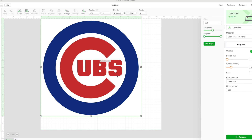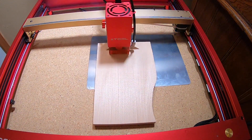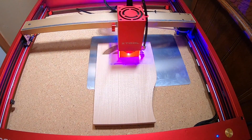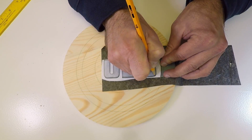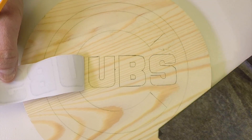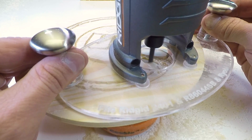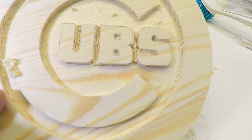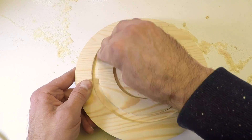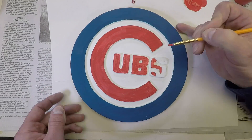I'm going to try making a Chicago Cubs painted logo on a three-quarter inch thick piece of basswood, but before I do it on the Xtool, let me show you how I had to do this before. First, I had to cut a circle of wood, then transfer the image using graphite paper. With my router, I used a profile bit to outline the letters, then a flat bottom bit to clean up all the in-between bits, then some sanding in preparation for painting. This is time consuming, tedious, and requires a careful hand at carving.